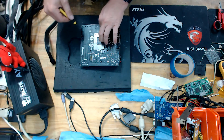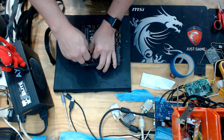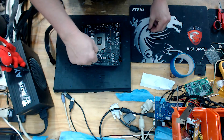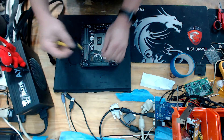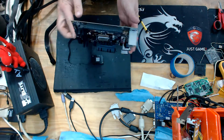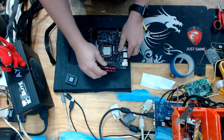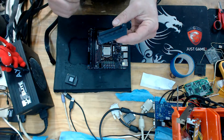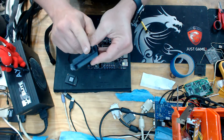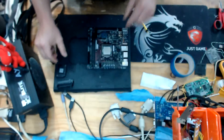This board is really quite straightforward — it's just two screws for the MOSFETs and two screws for the chipset heat sink. Nothing too strenuous there. Once that is off, we can flip the board back around. There's your little heat sink for your chipset and your MOSFET. The MOSFET will have a little thermal pad — just make sure that you get that off and that it's not shifted or damaged in any way. We'll put those to one side.